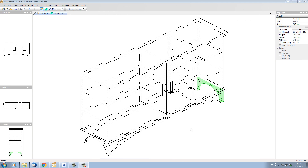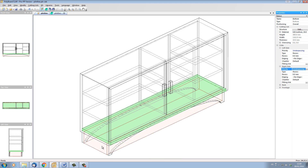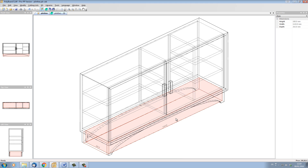So what happens if we change the priority of our bottom? Let's change it so that the bottom is actually between our sides — that is, underpassing the left side instead of overpassing, and the right side too, let's put it underpassing. You can see what Polyboard has done: it has eliminated the plinths as soon as we changed the priority of the bottom. So how do we get a plinth or panel on the end of our cabinet if we absolutely want the bottom to be between our sides? The idea is we go into the volume, click right, and instead of add a plinth — because with underpassing it's not possible to put left and right plinths — instead we add an upright. We put one upright and choose a distance from the left of 0. Polyboard adds the board to the left side. Going into the volume again, we add an upright at 0 from the right. Polyboard adds the plinth on the right side.